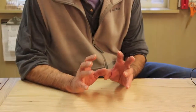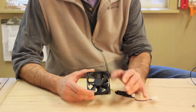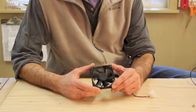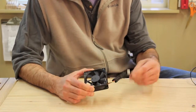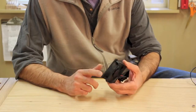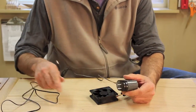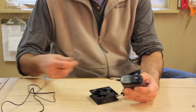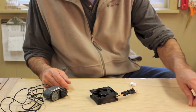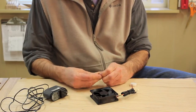So let's take a look. To build this little project, the first thing we're gonna need is a motor of some type. This is a fan intended for use in a computer — a cooling fan. You may have an old computer laying around with a fan in it, or you can purchase one. I picked this up for five dollars. Then you're gonna need a power supply. This is a twelve volt fan, so I found this old twelve volt transformer plug-in wall wart that came with an old modem I don't use anymore. And then we're gonna put a couple of rare earth magnets on this motor so that they spin around and will spin the stir bar.